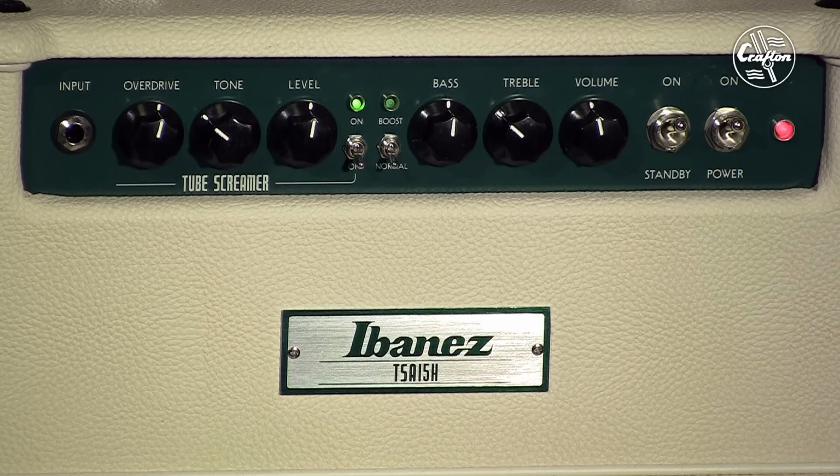This is also switchable with the foot switch. And the clean boost is wired after the tube screamer, so it doesn't really make your sound any dirtier. It just raises the volume 6 dB and opens up the treble a little bit. It's really perfect for all those guitar parts that you want to stand out, solos or anything.